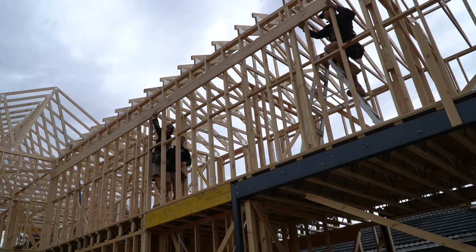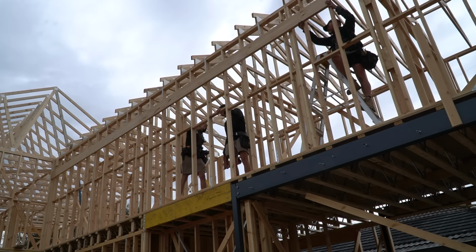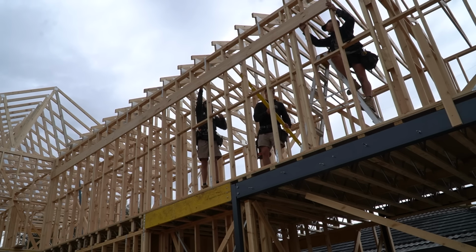Micho, can you measure 2390 in the center and we'll also check for level and check with our mark. Keep in mind we lasered the subfloor, so if we measure up it should be perfect the whole way through.